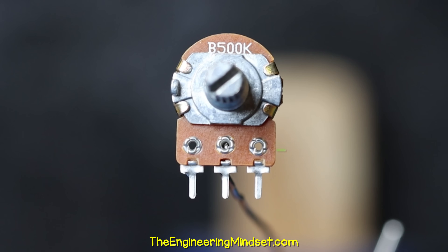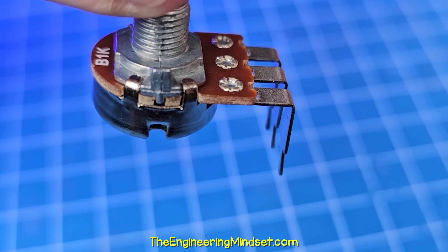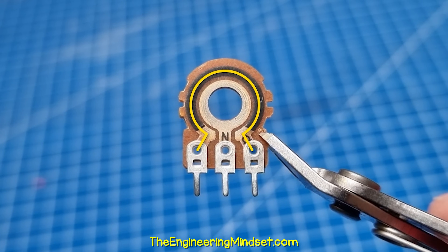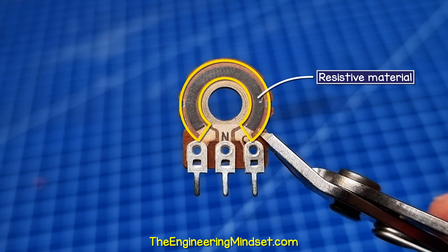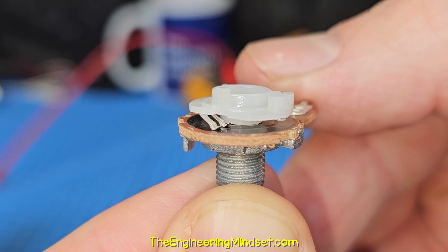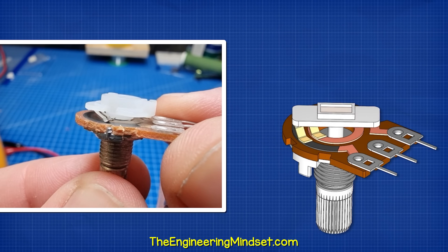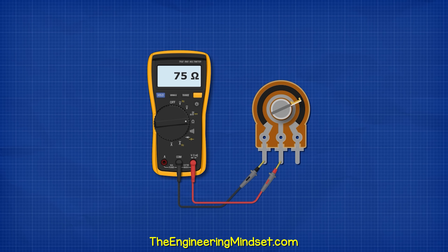Along the lower edge are three metal terminals. We connect our circuit to these terminals. These terminals can be straight or angled depending on the application. When we remove the back case, we can see there is a track which runs between the two end terminals. Another track runs in a loop at the center and connects only to the center terminal. The outer track has a very dark material over it — this is the resistive material. The track even looks like the symbol for resistance. A wiper forms a bridge between the outer and inner track. It is slightly spring-loaded to ensure a good connection. This is attached to the shaft.